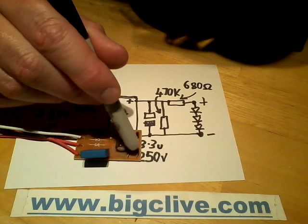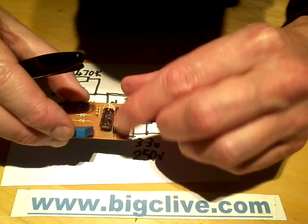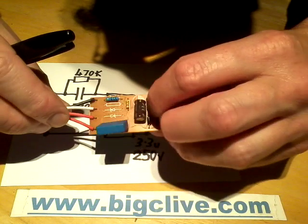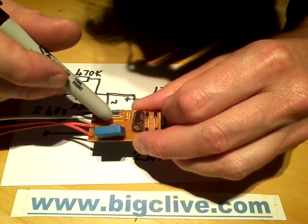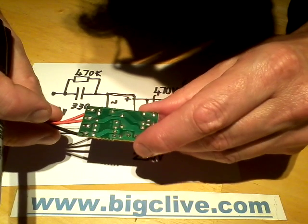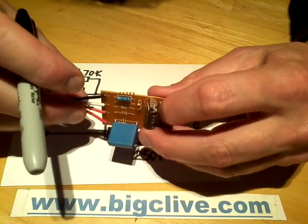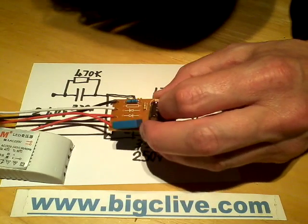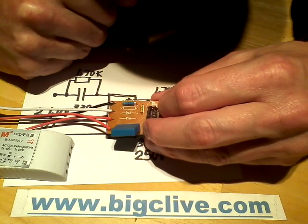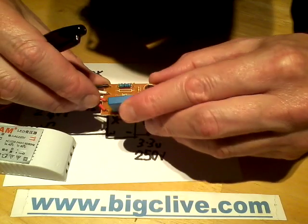I noticed there's another position for a rectifier in here. They've got a standard 4-pin single package rectifier, plus the option for the discrete diodes. There's a position for another resistor in series with those Zeners. Not 100% sure what that's for, unless it's to help take some of the dissipation away if they turn on. Not really sure about that. But they're not used anyway. And I'm guessing for the other ratings that they had on the label, they probably just use a higher value series capacitor, maybe going up to about 680 nano or higher. I'm not 100% sure. Maybe I should get some of the other ones and see what value capacitor it is,